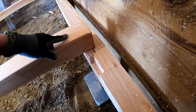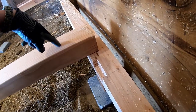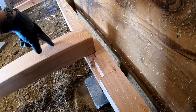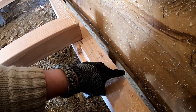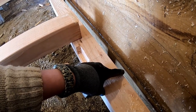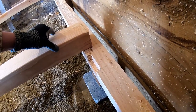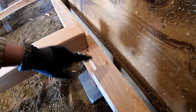This is a four-by-four. I got these four-by-fours from one company and these four-by-fours from Home Depot — both standard lumber supply places. When you ask for a four-by-four you get a four-by-four. But this one is three and three-eighths, although a four-by-four typically is three and a half. This other one is closer to three and a half, so it's a little bigger than all the pockets we cut.